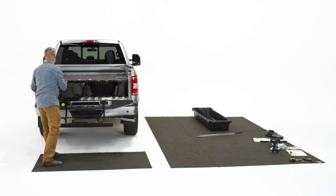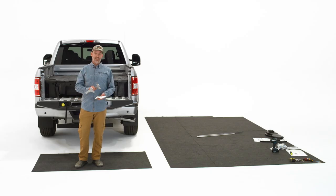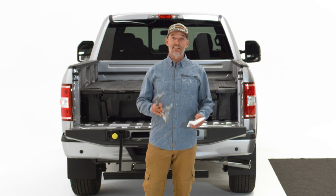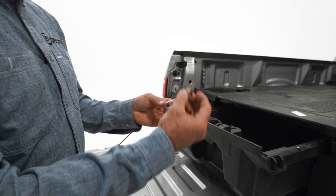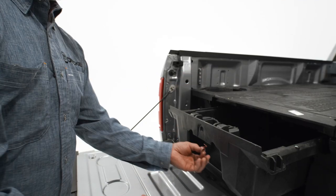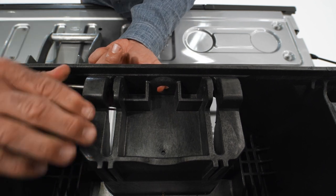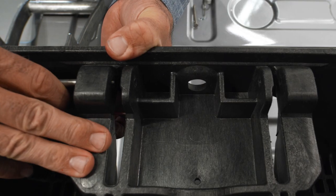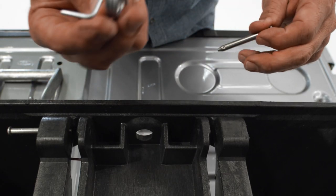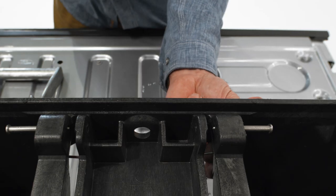We're going to put the drawers in. We've put one handle in already, but I'll walk you through installing the other one. There are two springs — a red one and a silver one. The red spring goes on the right: short leg down, the long bent leg going in with the hook pointing to the left. Slide it up into the cavity and push it all the way to the top, then stick the clevis pin through the hole and slide it right through the loop of the spring so it barely starts to poke out the other side. Now repeat with the silver spring on the left side — the vertical leg goes straight down, short leg. Stick it up in there so you see the silver part, then stick your clevis pin in so it goes through the spring and barely starts to poke out the other side.